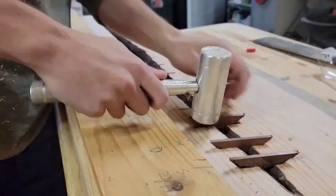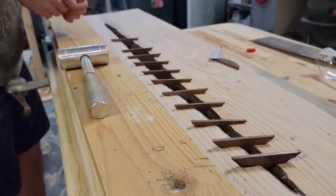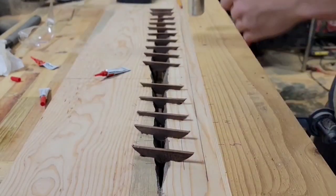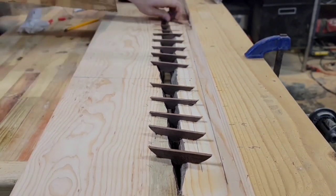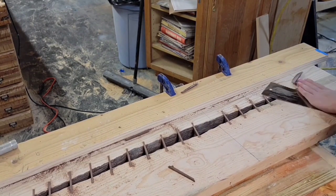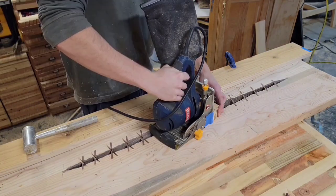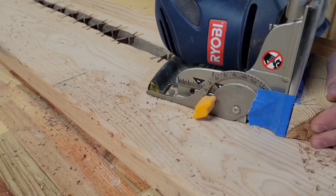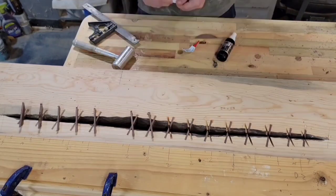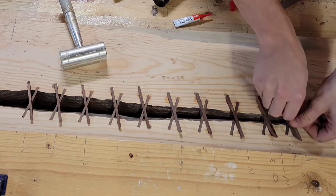When I cut these slots, because you can set the depth with a biscuit joiner, near the beginning and end of the crack I made smaller bow ties, and then towards the middle I made them bigger. Once I cut all those 15-degree slots going one way, I flip my biscuit joiner to the other side of the block and cut the other half of each stitch. I know these stitches have basically no structural strength — I just thought they'd look cool. This was something I wanted to try from my wine gift box video, where I was using the biscuit joiner in weird ways, and this idea just didn't fit that video, so I'm trying it out here.